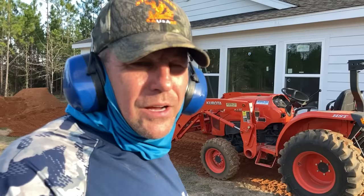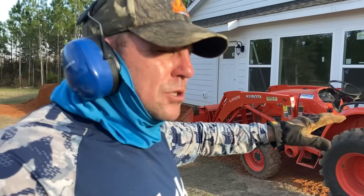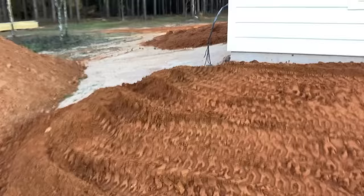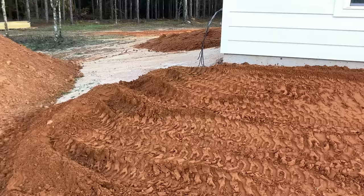Most of that water is going to come off the ends of those triangles at the roof line — that's what it was doing before, washing out. I'm trying to get it nice and packed so it'll stay, because once this is done the contractor isn't going to provide any more dirt. So it's in my best interest to get this packed. You can see here on the end where the dirt was deeper, the tractor was digging in. I was just going back and forth with the front tires — it's pretty heavy in the front end with the front end loader — and just packing that real good.